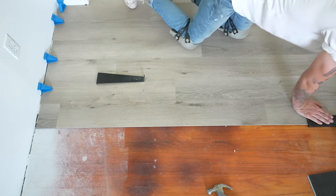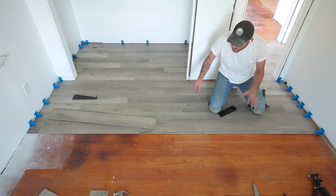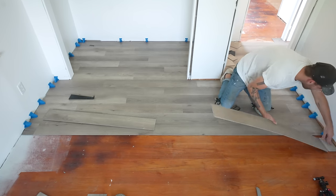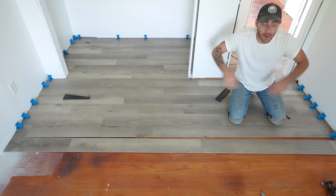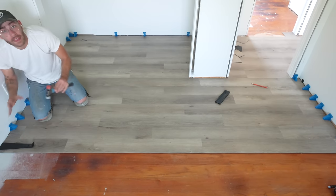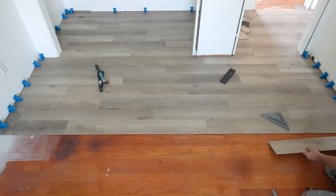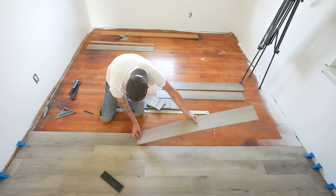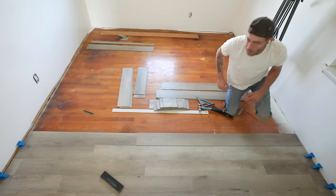You can also piece together your entire row and then attach it to your existing floor. You'll need pre-cut pieces — link all your planks together end to end. This is easier with a partner on the opposite end, but you can still do it yourself. Make sure you lift up the opposite end of your plank and work down the row, then knock the whole row in at one time. What's nice about this is you're limiting how often you switch between cutting and installing, because switching operations really takes time.